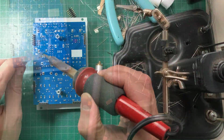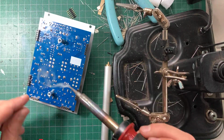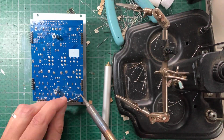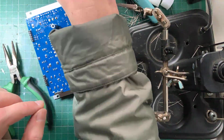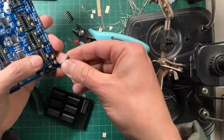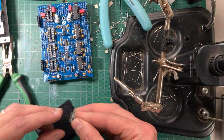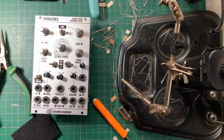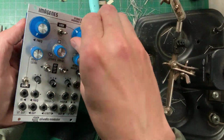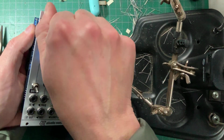Now you can solder on all of the panel components. Finish tightening the nuts. Carefully plug the ICs into their respective sockets, making sure they are oriented correctly and the notches all line up. Attach the boards together, tighten the spacers, and install the knobs. Congratulations, that's it. Just check the power header for shorts and plug it in to test and calibrate.